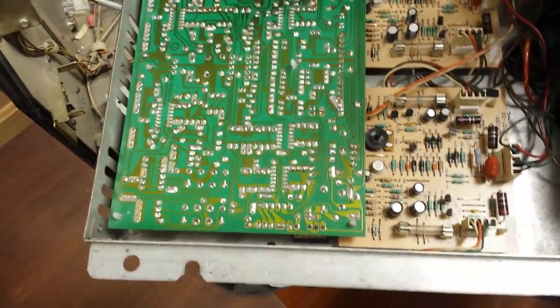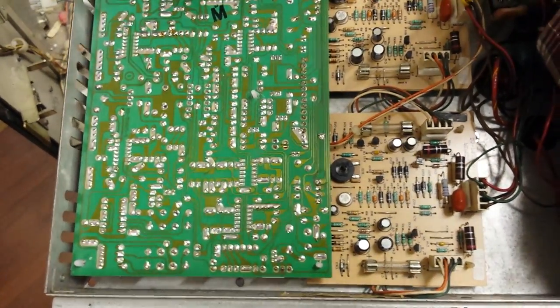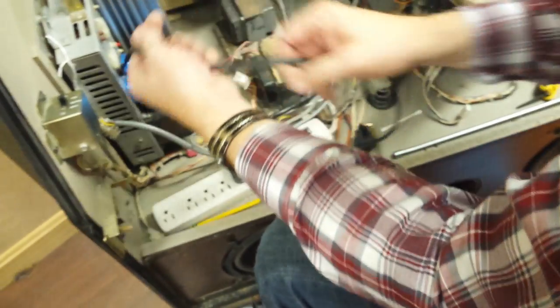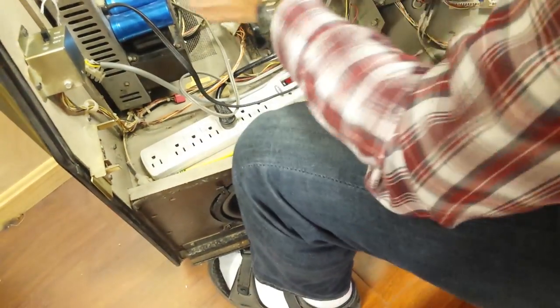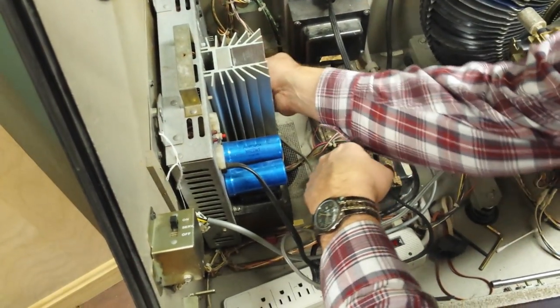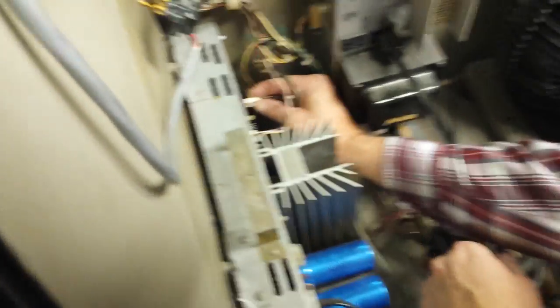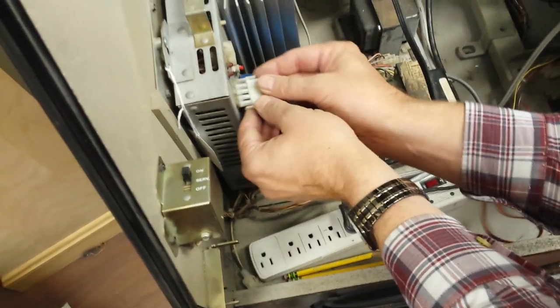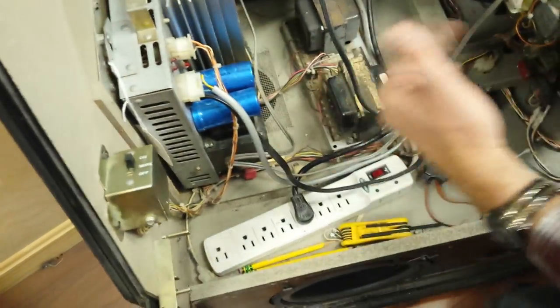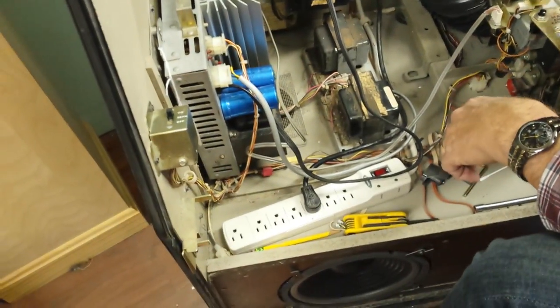What we just talked about for the record amplifiers applies equally to the CD amplifiers — they have similar designs with the same driver board configuration: two driver boards, one preamp board, and two filter caps, just in a different location. The CD amps have a little more output: 250 watts versus 125. But any one of these amplifiers would be able to blow you out of the room if you really want to hear it loud.